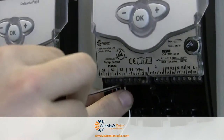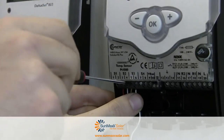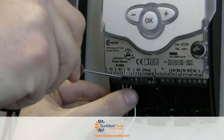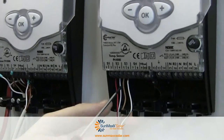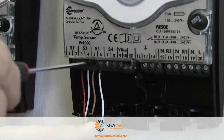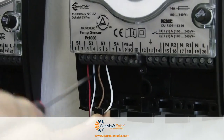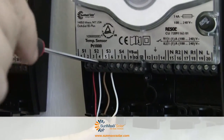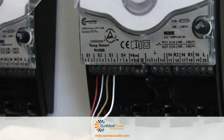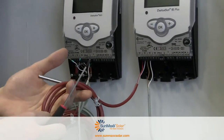Get this up and tighten this down. You can see we have a little bit of exposed contact — we want to fix that. Take this back out, push it back up in so all the contact areas are in there. Make a firm contact, and there we go. We have our low-temp tank sensor installed and our high-temp collector temperature sensor installed.